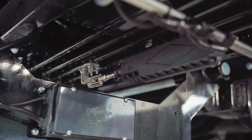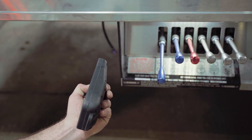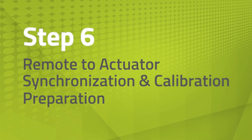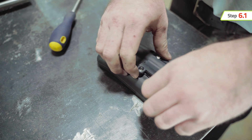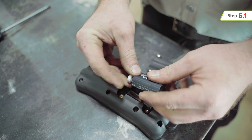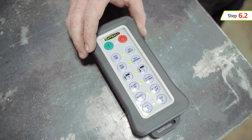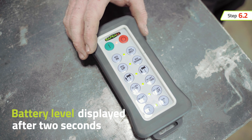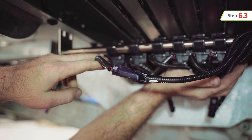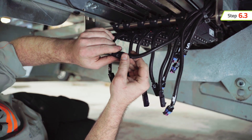After the Safeall remote kit has been properly installed on your car carrier, it's time to synchronize and calibrate the handheld keypad and actuators. Remove the battery tray cover by removing the four cover screws from the remote. Install a 9-volt battery and reinstall the cover. Press the green power button, which will illuminate the red and green LEDs confirming functionality. After two seconds, the green LEDs will display the battery power level. Only one actuator at a time can have power when syncing — all other actuators' power sources must be disconnected. Connect only one two-prong quick connector at a time when synchronizing.